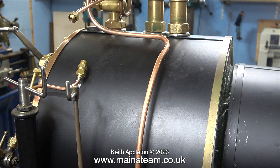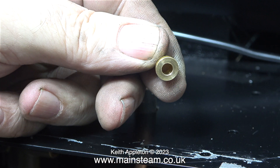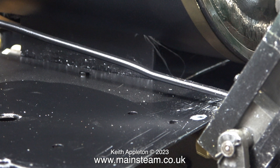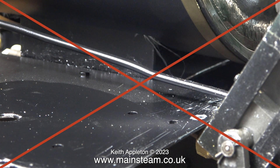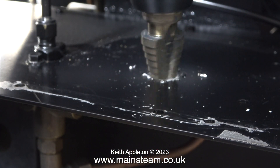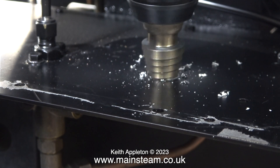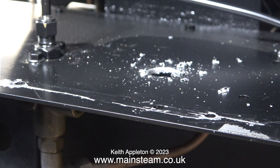In this video I'm going to make some mistakes — I'd like to be smug and say I did this on purpose, but this one is a genuine error. I fitted taper cone unions at both ends, but when plumbing a live steam injector always remember the unions need to be flat. This is so you can undo the injector and move it out of the way without disturbing the piping. The cone part of a normal union was mistake number one. Mistake number two: I don't normally work with injectors of this size and the union nuts are much bigger than a normal three eighths by 32 type. I heated the pipe to remove the original taper cone and fitted the larger union nut.